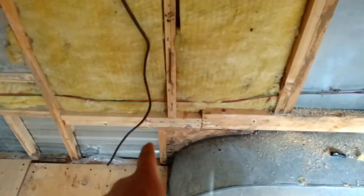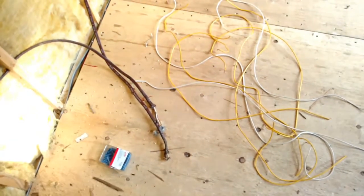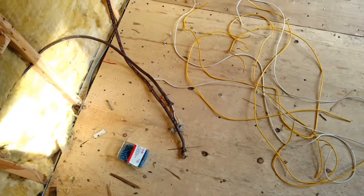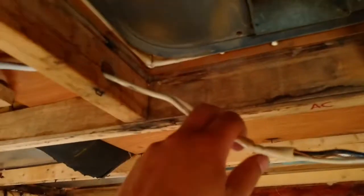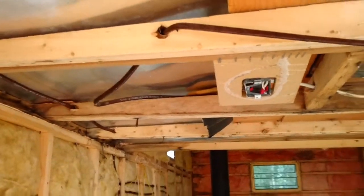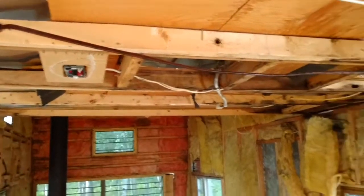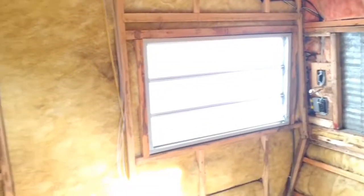The other AC circuit has a plug down there, another plug here for my computers, and one shooting out into the pony wall for my TV and sound system. On this same circuit, a wire runs up into the wall and into the ceiling, connecting to the AC unit — so once I have enough battery power or I'm plugged into the grid, I'll be able to run the AC on that circuit. That's pretty much it for the wiring.